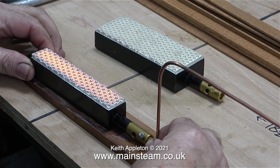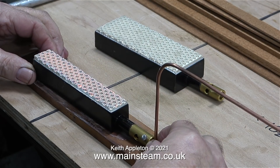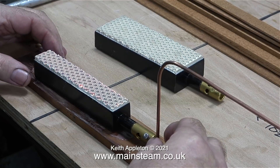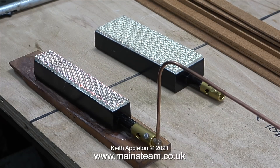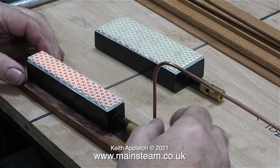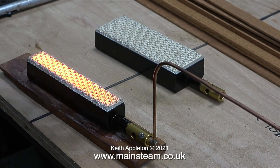But this type of ceramic is not supposed to glow like you see here. In this part of the clip, I'm pulling the jet out a little bit further, and this is where it all starts to go wrong. The amount of heat generated goes up exponentially. The further back you move the gas jet, the more turbulent the gas becomes, and the burner immediately starts to overheat.